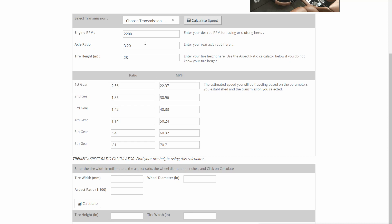One thing to note is that the Tesla tires are also 28 inches, so we should be able to maintain the gear ratio — which is 9 to 1 in the Tesla — with this 28-inch tire. So I'm going to use a 345/30 R20 tire; some Michelin's I was able to source. That's going to be some pretty big rubber on the back of this car. Before those tires and rims arrive, I'm going to get the car at the right ride height so we can order the frame rails. To do that, I'm going to create some wood blanks that are 28 inches high so we can put those on the car and do some frame rail calculations.